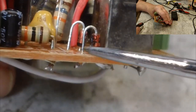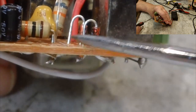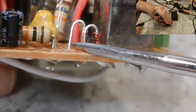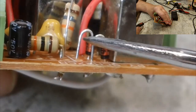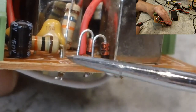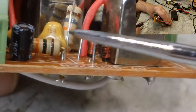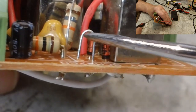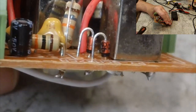And it is also striped towards the IF can, and then goes out. This is where I was picking up the signal, right here on the end of that, right before this diode or resistor here. Actually, this resistor here, the 10K. If you go after the 10K, that's where the actual AGC voltage is located, but you get the same action up and down here as you would there. I don't think there's any difference in that.